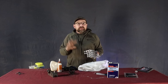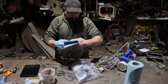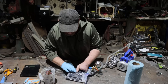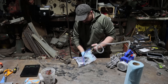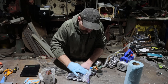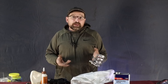Coat the cover sock with any resin left in the cup. Next, pull the inner bag over the layup and start smoothing out all the wrinkles. Add paper towels to any of the sharp corners. Seal up the vacuum bag and just start to add vacuum — you'll see everything start to shrink. Now's your time to start taking out some of the wrinkles. Once you have things kind of straightened out, close the valve a little and watch it shrink down all the way. Take a moment and work any excess resin either into the bleeder or into an area of the layup that's going to be trimmed away later, but be careful not to squeeze out so much resin that you end up with dry spots. If you do, it can be fixed later on, but better if you don't.